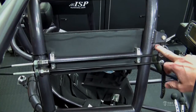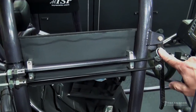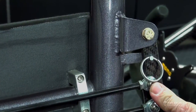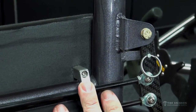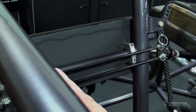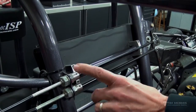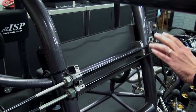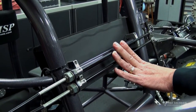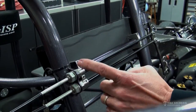This safety tab here can be welded anywhere in this location and then made for the little quick pin to fit in. The handle already has two holes in it to fasten the rod ends to. The only fabrication you have to do is tacking these tabs on. These two rods are quarter inch chromoly — they are going to be a little bit long. They have to be cut off on this end and then threaded to adapt to the cables, because this kit is somewhat universal and we can't set a fixed length.